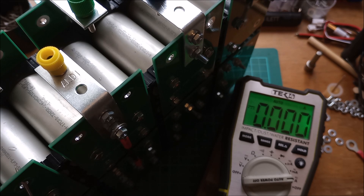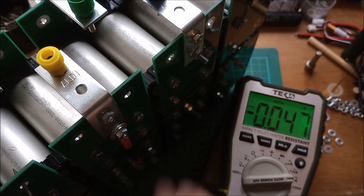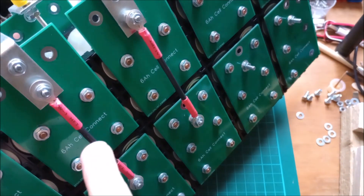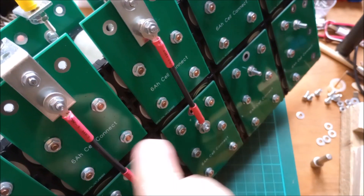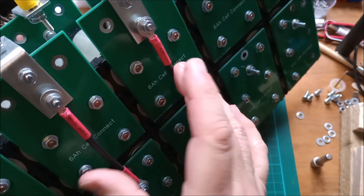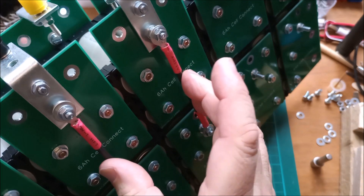Let's try the one on the left here — yeah, that's got a little bit more current: 60 milliamps dropping to 50. But again, it's not going to stress either my made-up cable or the cells themselves to have 50 milliamps of transfer current, so that's fine. I can just simply attach this piece of wire onto the battery now. That's the latest piece of wire put on — I'll just tighten that a little bit. I might set these closer to the boards when I build the final version, but I'll make up another one of these now. I think I need about five more of these.